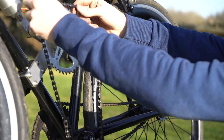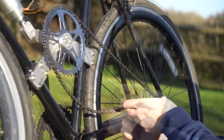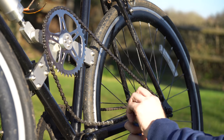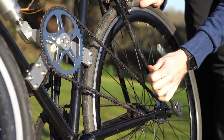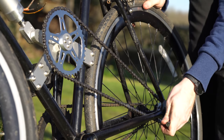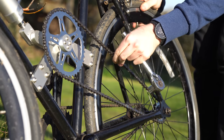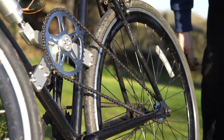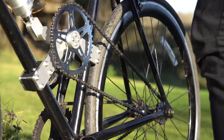The next most important part — possibly the most important part — the chain. I can't resist mentioning how perfect this chain length is. I was expecting to need a chain tensioner, but fortunately the drive sprocket position was so perfect that both the chain from the pedals and the chain from the crank were almost perfectly tensioned.